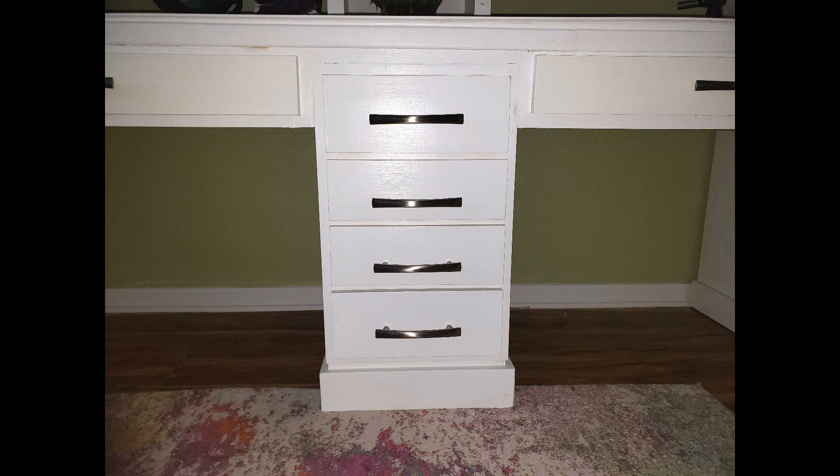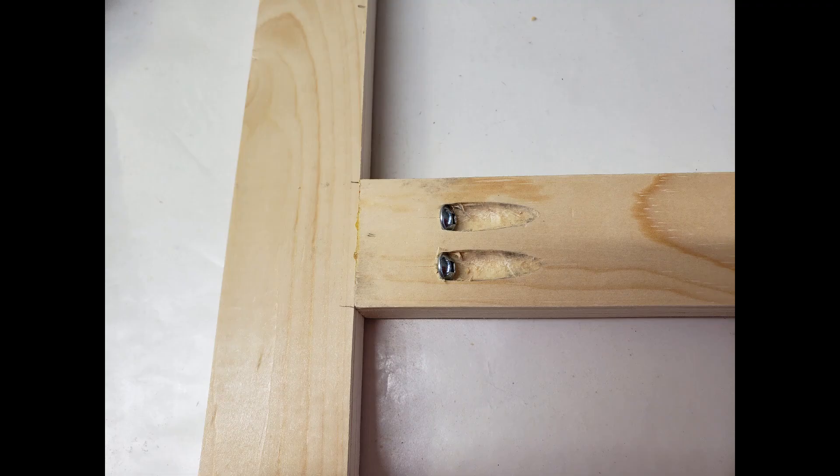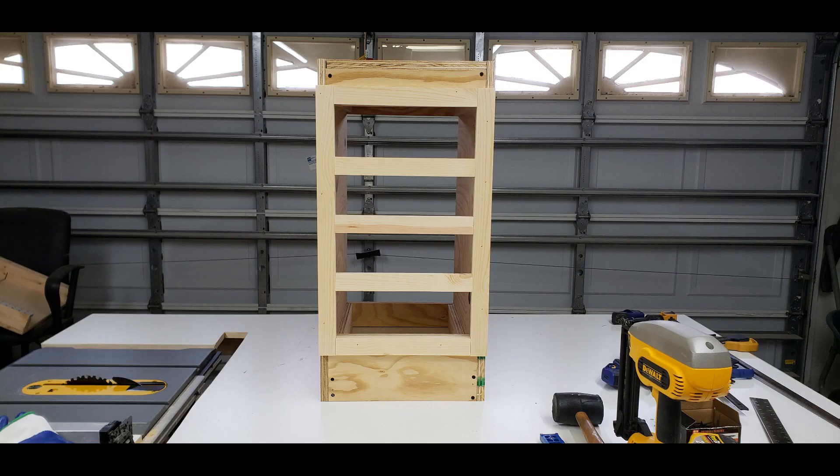Next we're going to make the middle cabinet. The middle cabinet is more narrow — I thought this might create symmetry and interest. This one has four drawers, but you have the option to make it whatever you want. I wanted the drawers to be deeper this time, and this center drawer will serve both work areas. Doors are options also. The construction is basically the same except this one has facing between the drawers. To make the facing, cut the pieces out, glue, clamp, and secure with pocket hole screws. When you measure for drawers, the carcass will be one inch less than the opening and the drawer front will measure one inch wider than the opening.